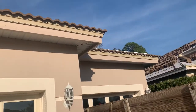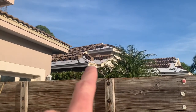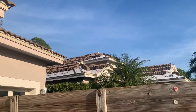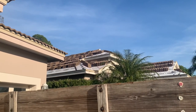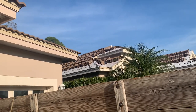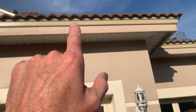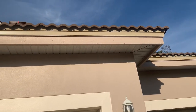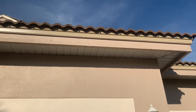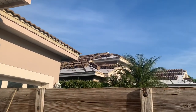Over here, we're also doing the house next door. You can see the underlayment on there, and that underlayment is a critical component of your tile roof system. The reason is water is always going to get under your tile — that's why they put those holes in the closure up there, so the water can get out. It gets under the tiles every time it rains. The question is: who keeps it out of your home?